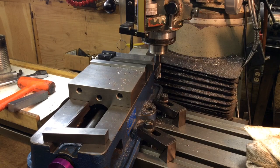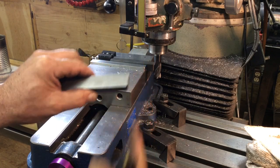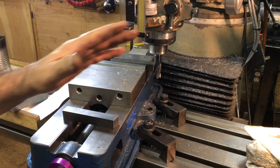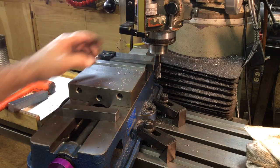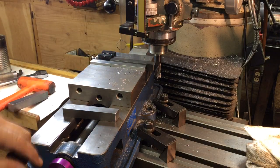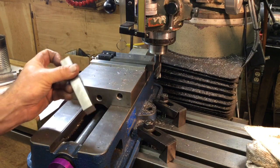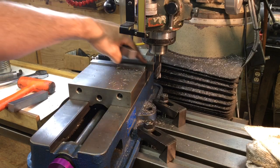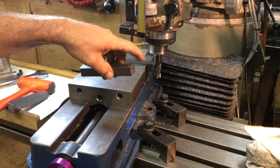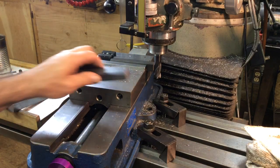So this is my first setup for the tool. What I'm doing is cutting a 10 degree angle on the end here. I have my vise turned 10 degrees and I use the DRO with the angle setting mode to set it at 10 degrees on the vise jaw - that's what I measured against. I've already squared my stock on one end, so I come in, put it up against the vise stop, and I'm milling it off to a specific length at 10 degrees.